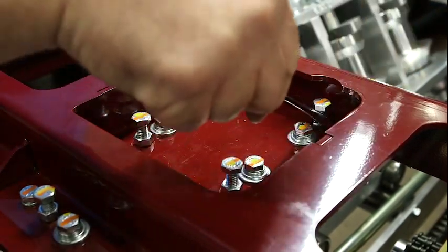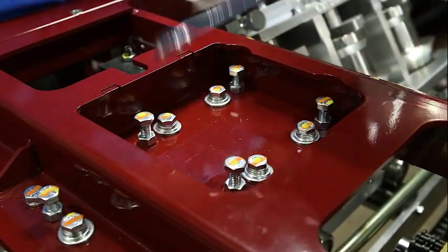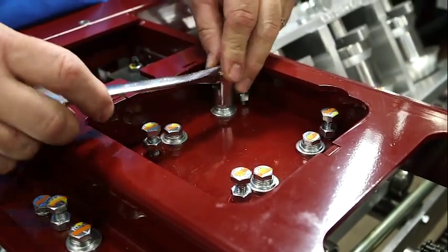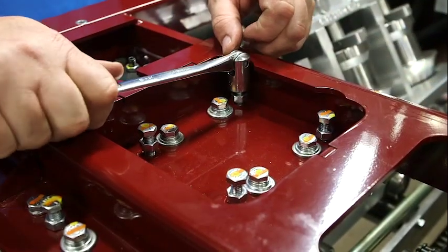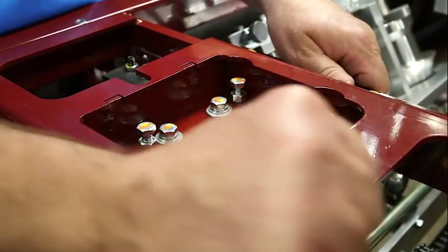The best procedure for adding pressure to a drive station is working clockwise around the bolt pattern one pair of bolts at a time. Choosing a corner to start from, loosen by turning the pull bolt — this is the lower bolt — counterclockwise a quarter of a turn. Then tighten the pressure bolt — this is the taller bolt — clockwise a quarter of a turn.